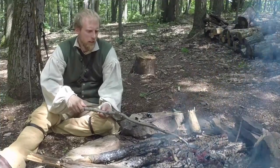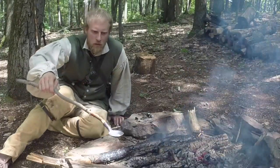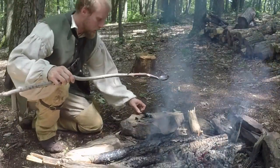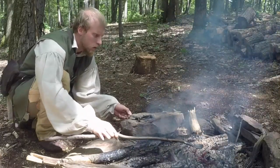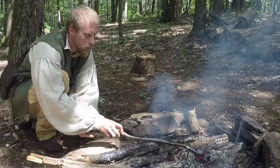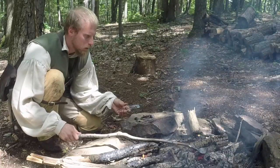So we melted the lead down, our lead shot. You just want to be careful with this. As you can see, hopefully, it became a liquid. So I'm going to take my bullet mold and get that. It's going to cool down. Throw that back in there for 1 second just to rewarm. You want that real good and liquidy.